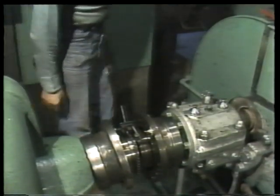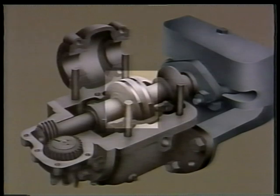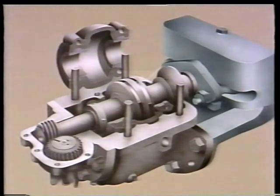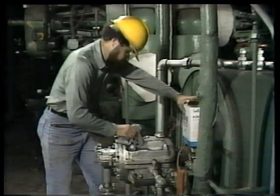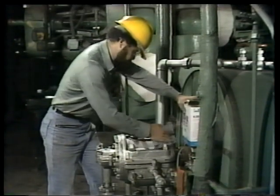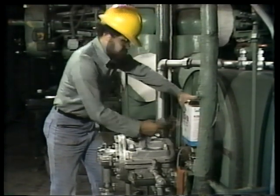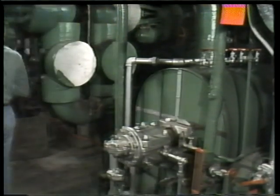The most likely explanation of this excessive clearance is worn thrust shoes. Since this pump primarily creates an outboard thrust, the outboard thrust shoes are probably the ones that need replacement. To find out for sure, we have to disassemble the bearing and inspect the shoes directly. Just like any other bearing disassembly, the process begins with cleaning the outside of the housing so no dirt or grit will accidentally fall inside. Then the housing can be unbolted — secured by four nuts, but this one also has a couple of extra features.